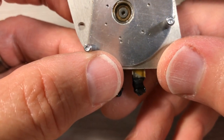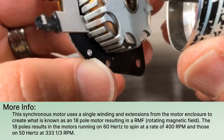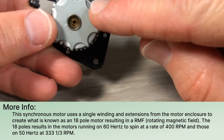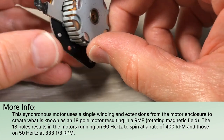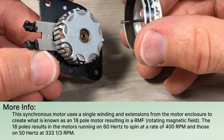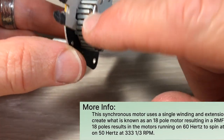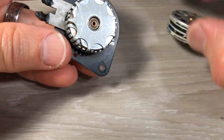There's a washer on top and a bushing under there — a certain type of bushing. I'm going to break that apart and cut it open so you can see what this particular motor has for a bushing. That metal part causes the motor to have poles — this is an 18-pole motor — which causes the motor to run at 400 revolutions per minute on 60 hertz, or 333 and a third RPM on 50 hertz. That's all about motors; I'm not a motor technician, and there are other resources if you want to learn more about that.